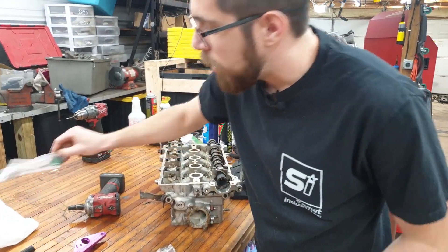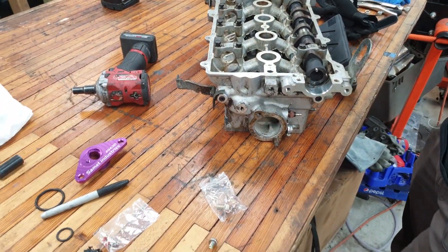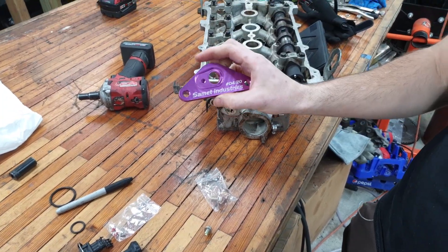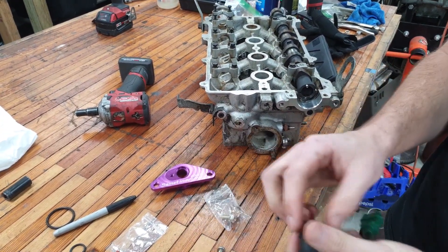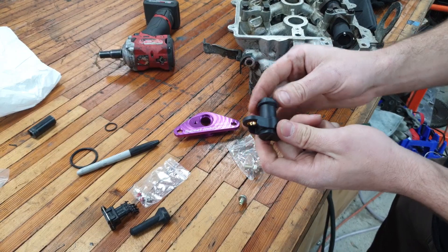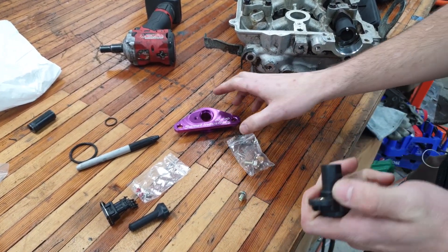Next we will want to open our sensor. This is the extra step only for the people that ordered the limited edition purple ones. There was a slight difference to the machining on those versus later ones, so we need a thicker O-ring. The sensor comes with one - if you have a purple one, take off the thin one and put on the thicker one that comes in the kit. If you have any of the gray ones, you don't need to do that.